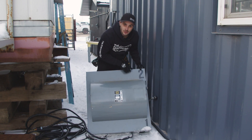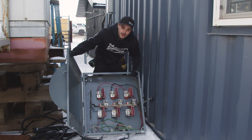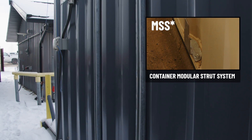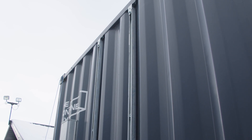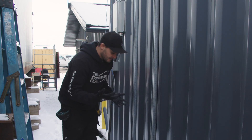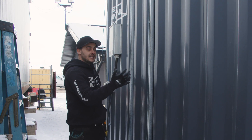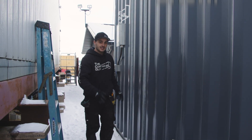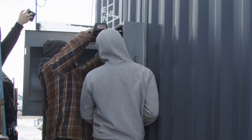Two will be utility, one will be battery — you connect to these lugs for one or the other. Here we've used our CSM exterior brackets, which allow us to mount strut channel to the outside of a shipping container. They're a slightly shallower profile than our interior CSM brackets, and we use them at the bottom and the top. Now we have two strut channels mounted vertically, and we can hang 1,500 pounds on each one. There are spring nuts ready for the transfer switch to be mounted — we've measured and drilled the holes, so we just have to hold it up and bolt it in.